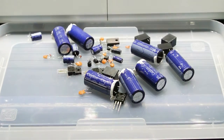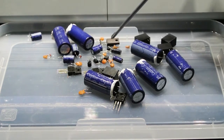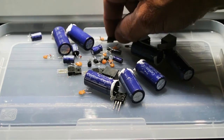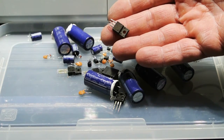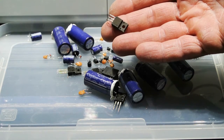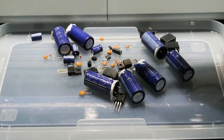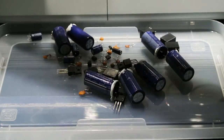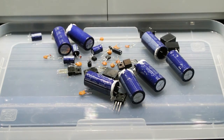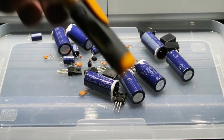What you were listening to was Robert's repaired IMA 4406 master station. What you're looking at here in the tray are the parts and components that were replaced to solve the problem. This is the voltage regulator that we sprayed the freeze spray on, which caused the audio to come back until it overheated again and then the audio went away. The set's been on now for about a half an hour. It plays fine. I've tested the intercom. I've tested the chime module. It all works correctly.